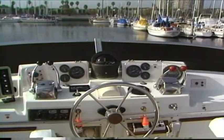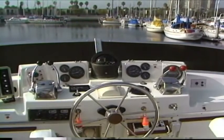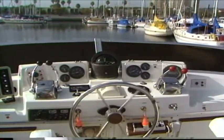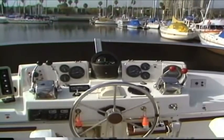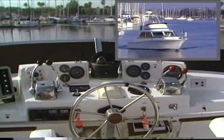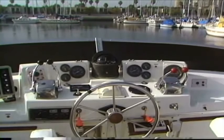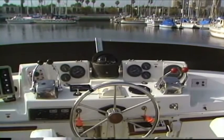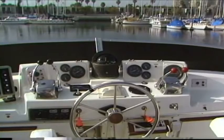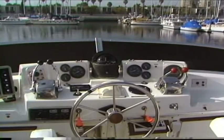In your harbor, at a speed of five knots forward, if the starboard engine quits on you, you can still make very wide turns towards port, or in this case, the operating engine. They'll be very slow and very deliberate, but you can still make the turns. However, at one knot — docking speed — with the wheel hard over to port and the starboard engine out, the boat will not, and I repeat, will not make a turn in the direction of the operating engine. This is the most important fact to keep in mind when attempting to enter your slip with one engine out.